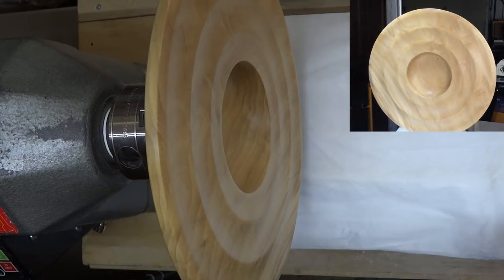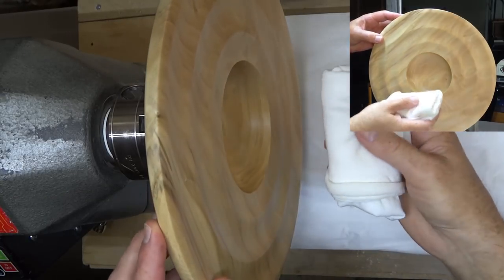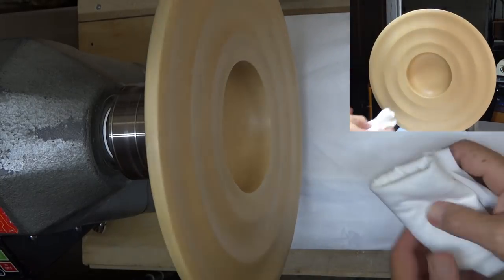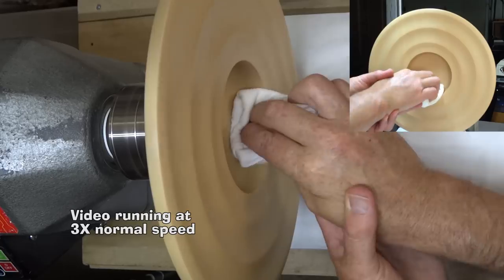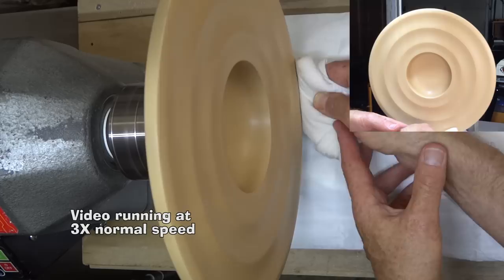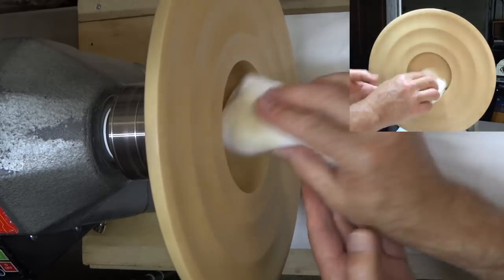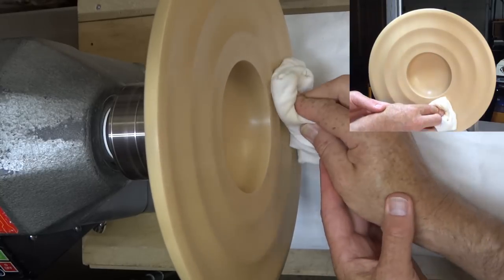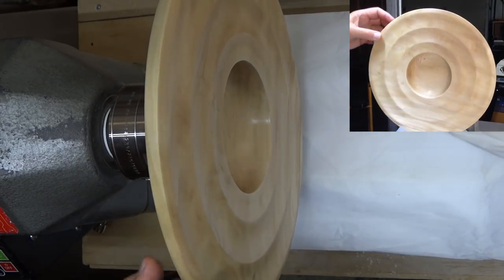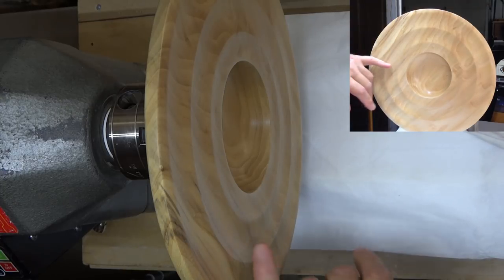All right, it's had time to dry. I've turned this up to 2000. I'm using a large pad of this stain applicator cloth, which I will mark dedicated to Hampshire Sheen. And let's see what this does. That is a beautiful finish. I quite like that. I'll just take it off now so I can compare the two sides.